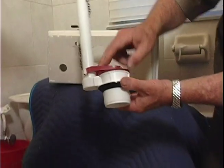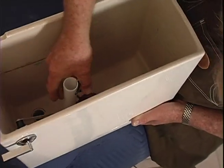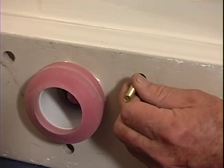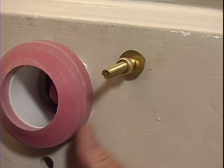This is the new flapper valve. I'm going to insert it down into the tank and then screw this on. Next, I slip a new gasket — it's part of the repair kit — over the large nut, then install the bolts, washers, and nuts that will allow me to secure the tank to the bowl.